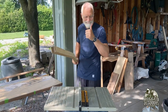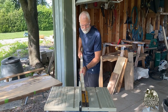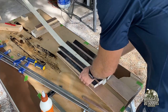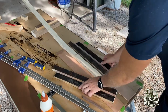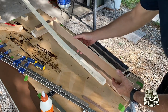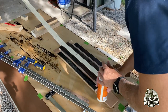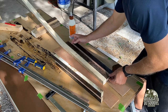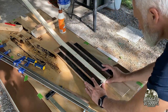This is day two — the shaft dried overnight and is ready to continue. We're shaving the edges of the shaft because they're not perfectly smooth from the gluing process. Once that's done, you're ready to glue the two blade pieces together. Make sure everything is clean and very flat — this joint takes a lot of pressure on every stroke. I used two small wood lifters to position the blade sides at the middle of the shaft, lifting them up so everything sits symmetrically before shaping. Then clamp everything together as tight as you can without warping.